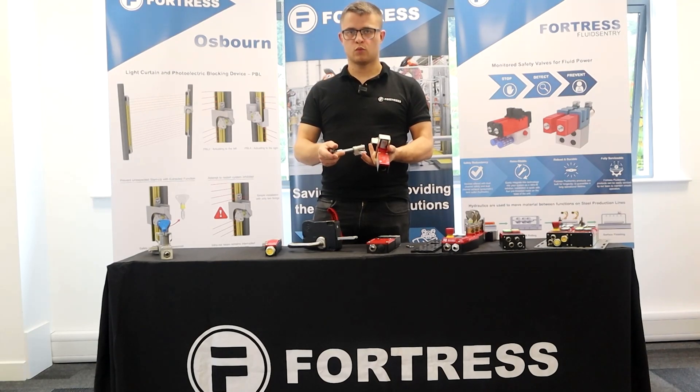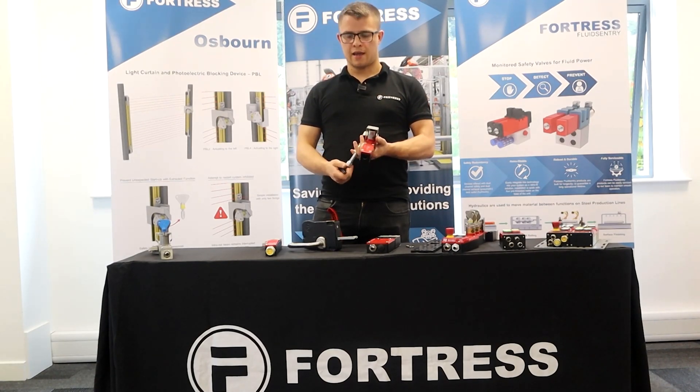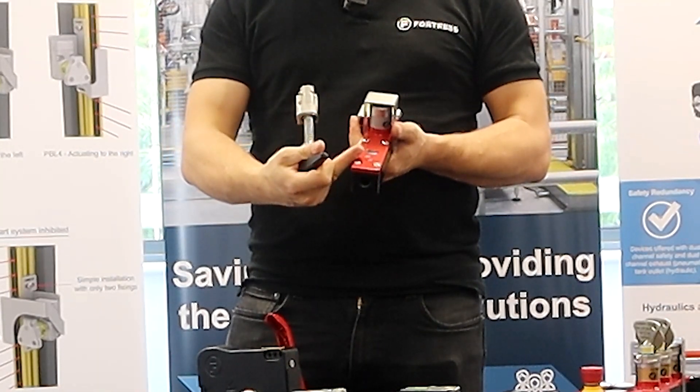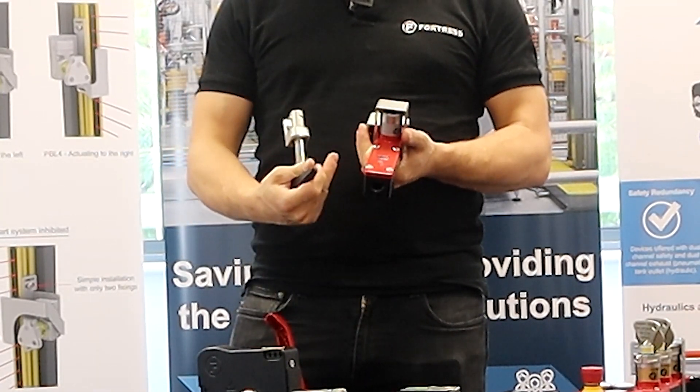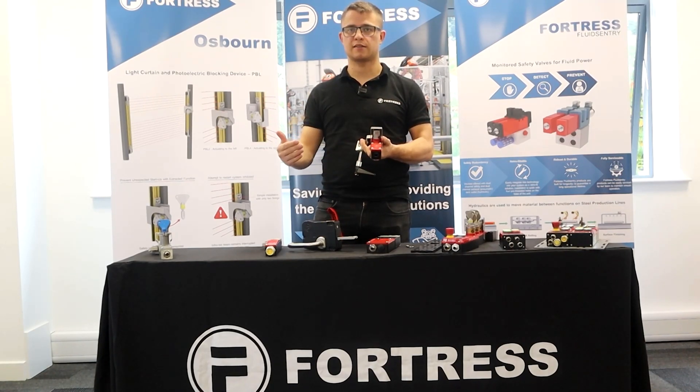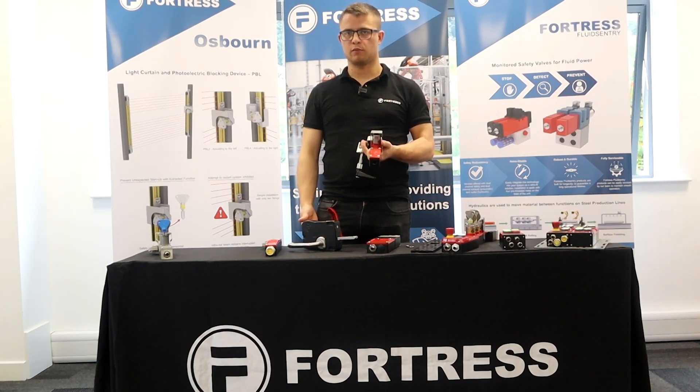The unit was locked by having the key inside. Why is that important? Now I cannot close that door and I cannot remake those safety contacts until I bring that key back in. That means if I'm an operator entering inside a large safeguarded space, even if the people outside the area can't see me, I'll be protected because I've got that key with me.